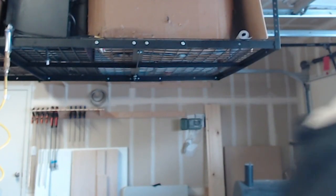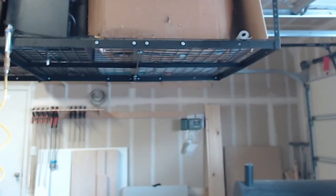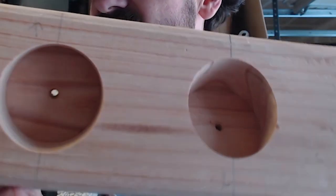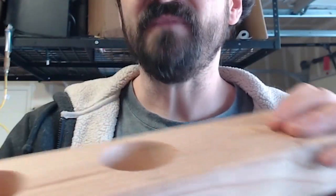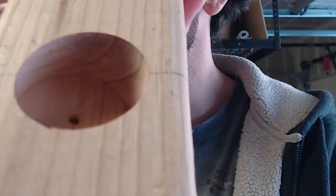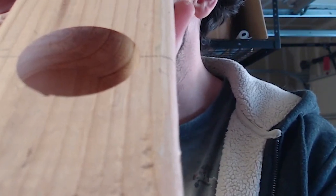And the way that I did that is I used my cute little drill press here with my little angle-able vise set at 15 degrees, and I made a jig. These are the actual jigs that I'll be using doing these holes. You can definitely see the angle here, I think. Well, not really, I guess.